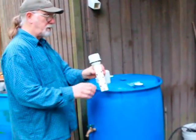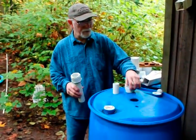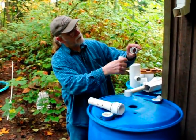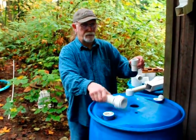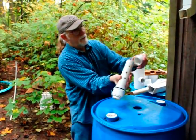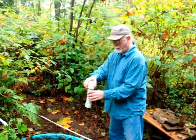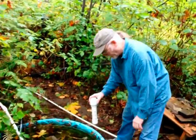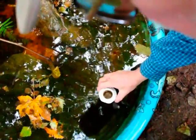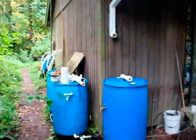Now we're going to look at the final assembly — first the float valve assembly. We have a ping-pong ball, a half-inch slip cap, an inch and a half adapter, and an inch and a quarter pipe beveled on the bottom. The little groove goes on the top. The adapter makes it fit — this slides in here, we make sure it's tight, ping-pong ball goes inside, slip cap goes on. Just a quick demonstration: when the water comes in, the ping-pong ball floats and seals — it's in the water but water isn't coming through.